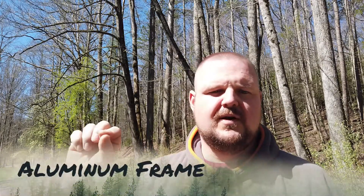This next part you have to be very careful with because I was afraid of breaking the window. My plan was to put a regular self-tapping screw with a pretty large head through the plywood all the way around, going into the aluminum screen around the window screen. I kind of overshot that a little and it ended up going into the actual aluminum of the window frame, but it didn't hurt anything — it's fine. There will be some holes left if I take them out, which irritates me because it's not what I was going for, but it works.